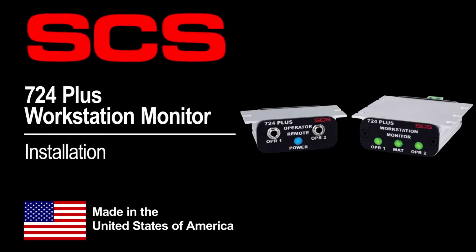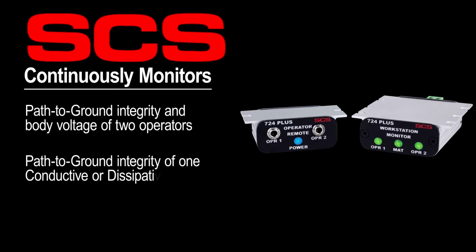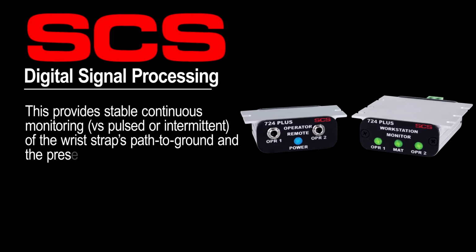The SCS 724 Plus Workstation Monitor continuously monitors the path-to-ground integrity and body voltage of two operators, as well as the path-to-ground integrity for one conductive or dissipative work surface. The 724 Plus Workstation Monitor is designed with digital signal processing technology for true continuous monitoring of wrist strap functionality and operator safety according to accepted industry standards.